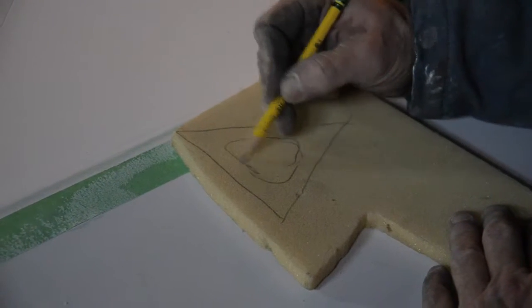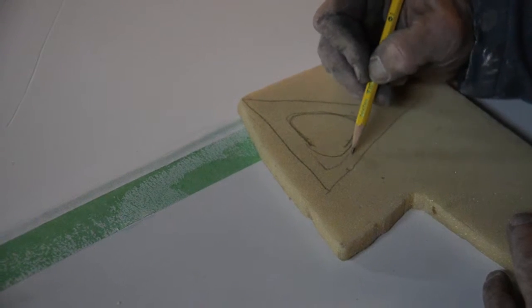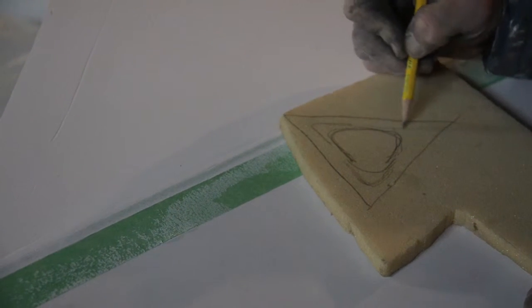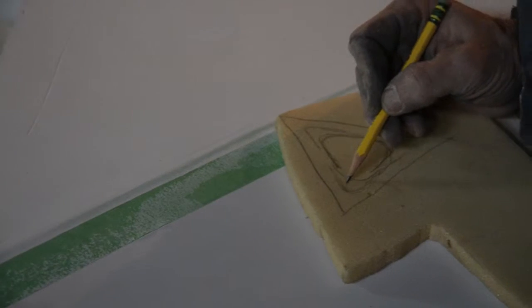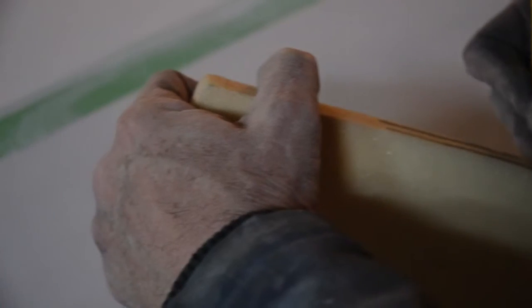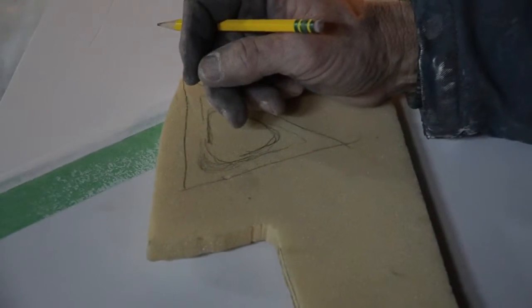So are we just cutting out for weight? Nope. Now, let's say you might have been able to do this, okay? In this area in here, reduce this thickness. There's a little ledge in those. That's what you're saying, right? Yes. You make like a gusset. If you were to weld a metal gusset in there, it would look like a gusset. So if you just do a rebate and then glass down onto that, that little change will give it big strength and structure through these corners. And it's pretty stinking easy to laminate.